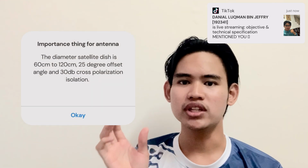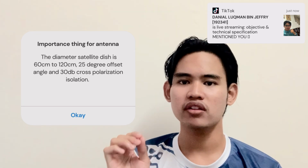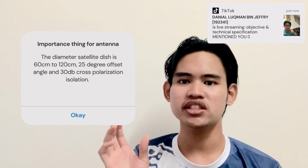The important thing for the antenna is that the diameter of the satellite dish should be between 60 cm to 120 cm, and it should have a 25 degrees offset angle and 30 decibel cross polarization isolation.